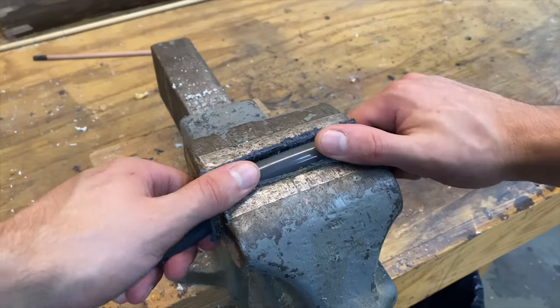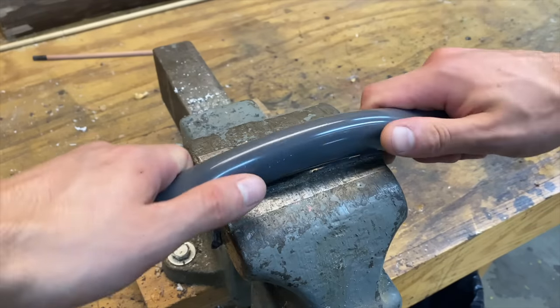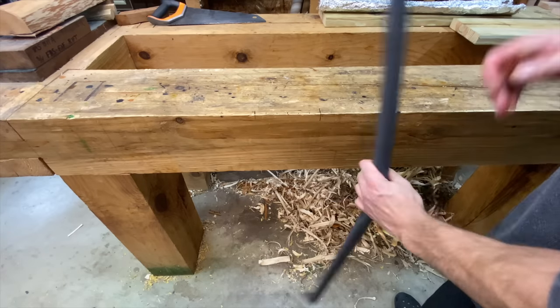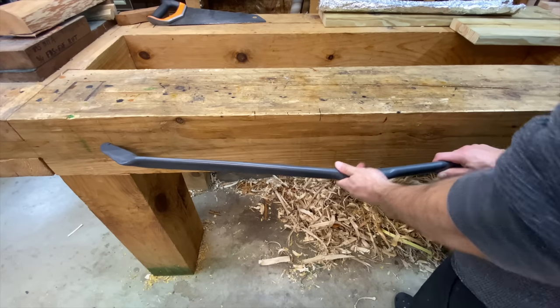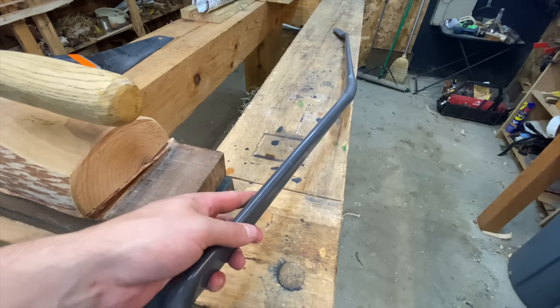In theory, reflex adds additional energy storage and performance, but in practice it also invites issues, such as alignment problems or overstressing the material. If you'd like a bit of extra margin for error, or you're just getting a little frustrated with the build, make things easier for yourself by skipping that reflex at the handle.